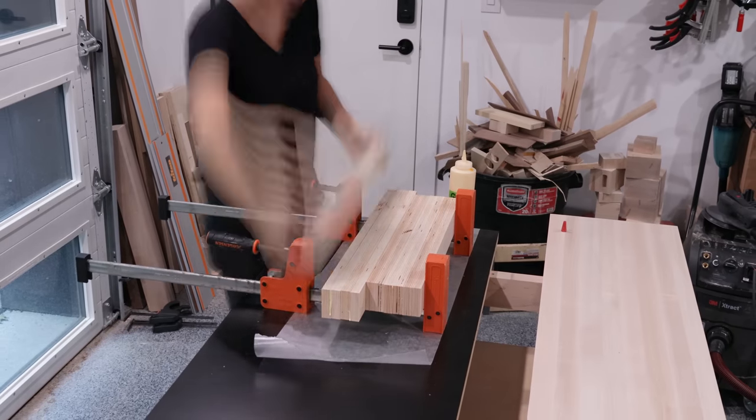Back to the walnut trim. These pieces could probably just be glued to the edges of the torsion box, but I needed to address the little dip in the top I made during the glue-up. As you can see, light is shining under the straight edge — no bueno. So I ripped a scrap piece of plywood to be slightly taller than the cabinet opening and clamped the edges, which simulated screwing it all down, and voila — no more light. My thought process was to keep that middle lifting scrap in place while I did the glue-up, and the dominoes also help keep it all straight. After one long edge was good I glued on the short sides with dominoes and finally put the last long edge in place. Crisis averted.